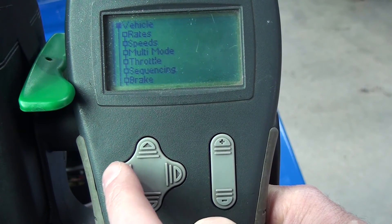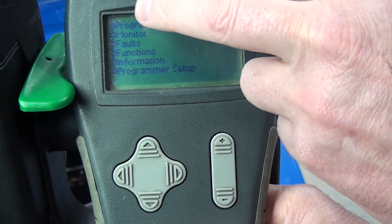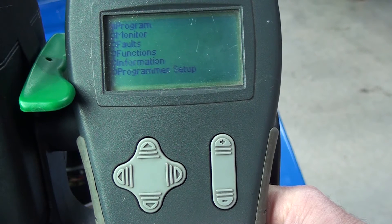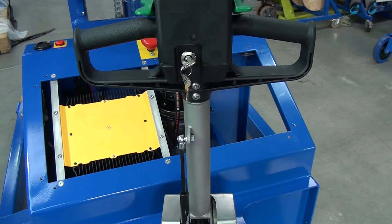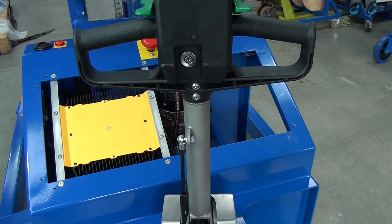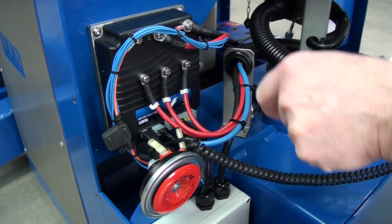Go back on the key — back again, back again. We're back in programs; you can see the icon flashing. So what we do now is power down the unit. We've now changed the program settings, so before we unplug the cable of the programmer, we power down the unit again. Programming is now complete — we've powered down the unit and we can disconnect the plug.